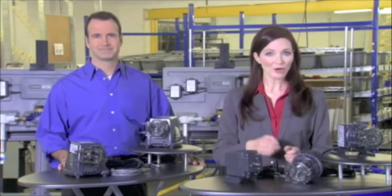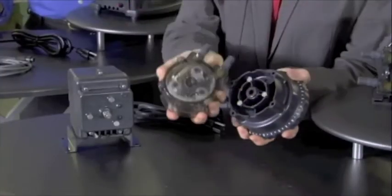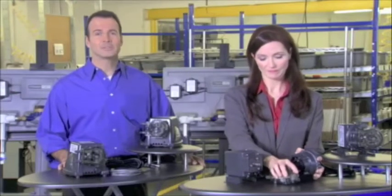Stenner manufactures several different pump series. As we saw in the factory tour, the pumps are manufactured as sub-assemblies first and then assembled according to the specific model. The sub-assembly snap-fit modular design allows easy conversion to another model within the same series. The components are secured by stainless locking rivets, so the pumps can be disassembled quickly without tools, and that saves time. Right. Valuable service time.